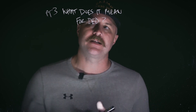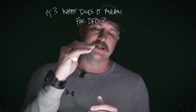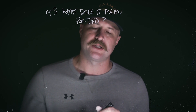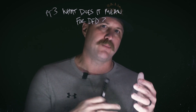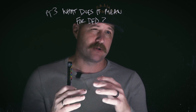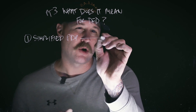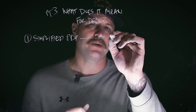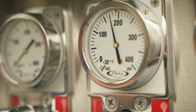The first question that almost always comes up is: you're giving us three tip options on that Elkhart cutoff — the constant gallonage fog, a seven-eighths, and a 15/16-inch smoothbore tip — so does that mean I have to know three different discharge pressures or PDPs depending on what tip we pull? The answer is actually no. The genius of this package is a simplified PDP so that regardless of which tip you're using — fog, seven-eighths, or 15/16 — the PDP on the individual line is going to be 165 to 175.